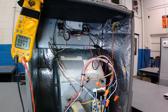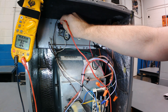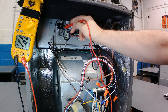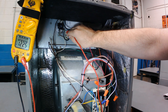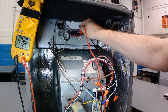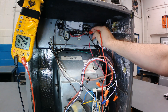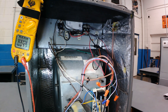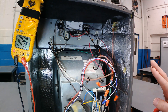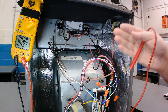With the heat running, I'll repeat the checks and see what the voltage readings are. Terminal block: power is there. Power going into the sequencer switch: 121 volts. Coming out of the switch: 122 volts going into the heater. Out of the heater: still there. Into the safety: still there. Out of the safety, back to the other side of power. All the readings were the same whether the heat was running or not — everything was the same.